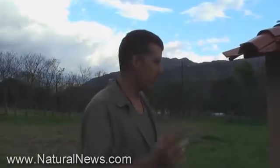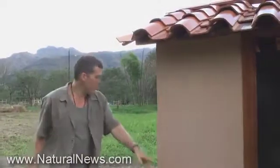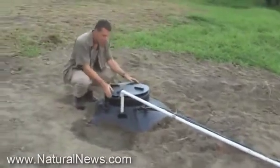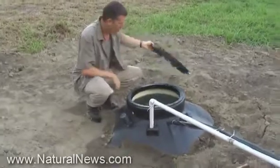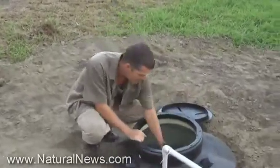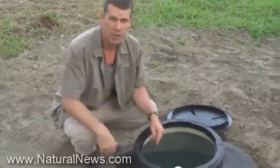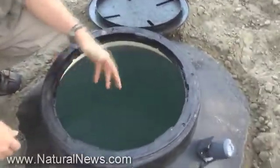It's several days later. We've actually built an irrigation system using the Brumby pump combined with a second pump on the surface — it's a lot less expensive, just a one-horsepower surface pump to provide some pressure. Inside this pump house we have the Brumby pump and an air compressor driving it. That water comes out through this hose and goes into this holding tank — a 2,500-liter holding tank. It's also really pristine water. I'm going to turn on the Brumby pump and show you how clean this water is and how it pumps the water in here.